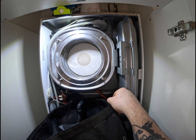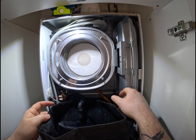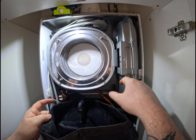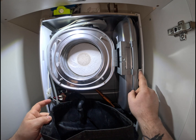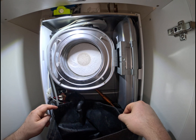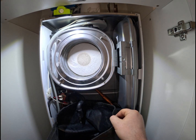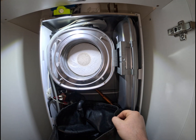Right, so we'll wait for that to drain, then dry that out and put it back together. Then we'll kill the pressure in the heating system, double check the expansion vessel while we're here, and then do the safety checks. We won't go into too much detail but you can see some videos of me quickly doing them.